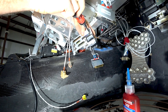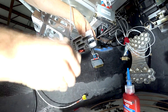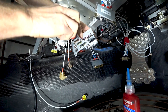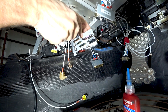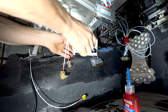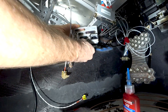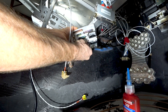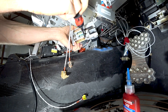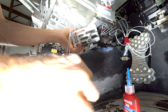Once all the connectors are in the back plate, that whole plate gets screwed into the back of the housing the GTN 750 slides into. When you slide it in, all the connectors self-engage, including the three antenna connections. There's a little allen key hole in the very front of the GTN 750 — you insert the allen key and turn it, working a cam system that draws the unit into place without having to push it manually. Turning the other way slowly pushes it back out.